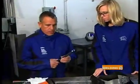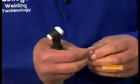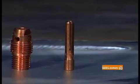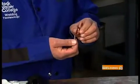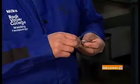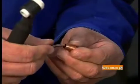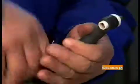Could you explain the different components that go into the torch itself? There are a few components needed to assemble this torch. First, we have a collet and a collet body, and these are matched to the size of tungsten you're going to use. This happens to be a 3/32 tungsten and 3/32 collet body — they need to match. These hold the tungsten in the torch and are threaded into the end until finger-snug.